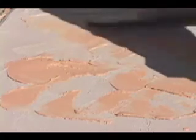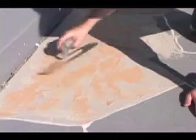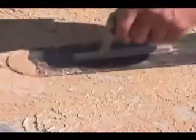Next, add in your desired mix color. Skim it randomly into the surface with your trowel, like this, over a manageable area within easy reach. This action will also create secondary blended colors for an attractive effect. When you've got your mix color satisfactorily distributed, pat the surface with the flat side of your trowel, like this, to stipple up and further blend the wet material.